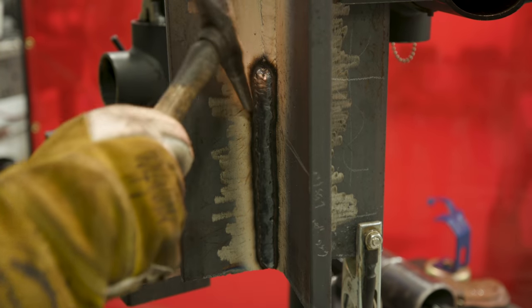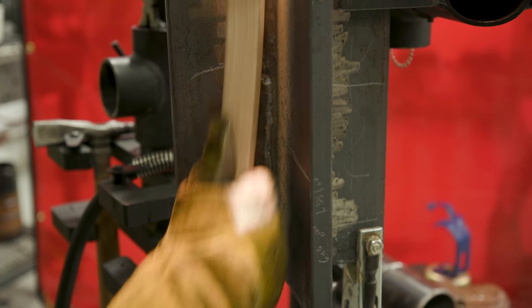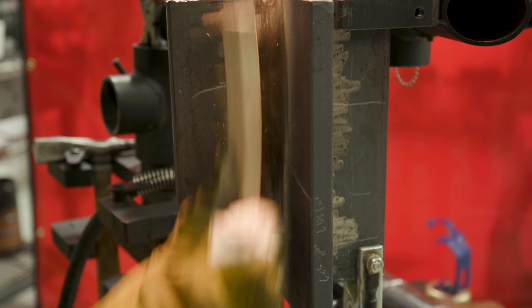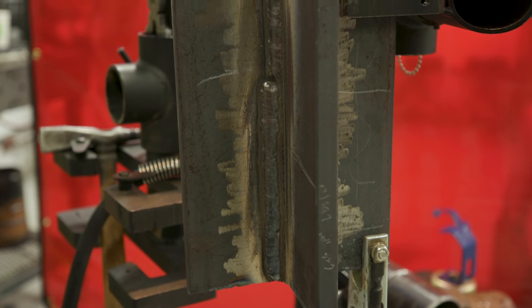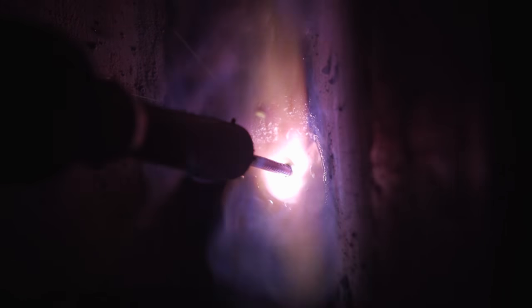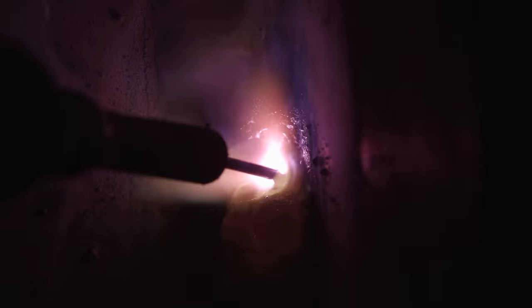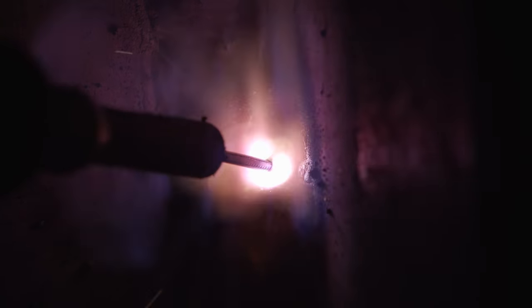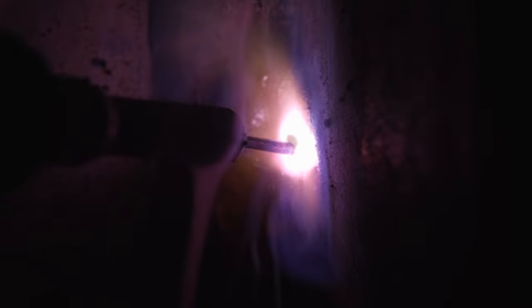With this specific type of wire — like your T6's and T8's — it's got a more glossy appearance. You don't have the typical ripples like you do with a 7018, other self-shielded flux core wires, or even regular solid wire GMAW. It just looks like a shiny slug that sits in there, but it's a very strong weld meant for seismic applications. This type of wire often falls under D1.8 code; however, I'd have to double-check, but I think it would also fall under D1.5, which is the structural steel bridge code since that's also a cyclically loaded structure. If you use this in bridge applications under D1.5, go ahead and post something in the comments — I'd be interested to learn more. Last time I ran this was about 2010 when I was with the ironworkers union. The puddle is a little bit thicker because the slag is a little bit thicker, which makes it really great for going out of position — all your verticals, horizontal groove welds, overhead, and such.